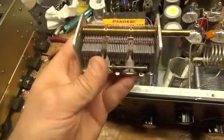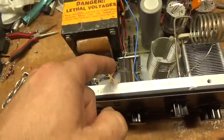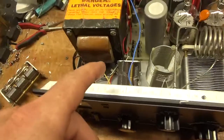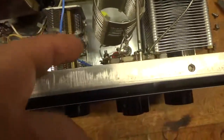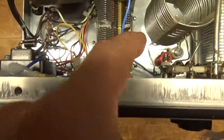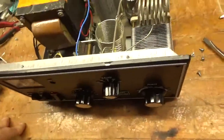These plates were rubbing — it was damaged, so I replaced this with one from Ameritron. They still use this in the AL811 and AL811H. Someone went in here, changed the tappage on the rotary switch, and then the connection down there was disconnected at the end of the coil. Just a nightmare, all messed up.